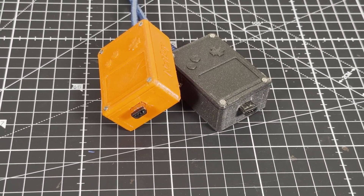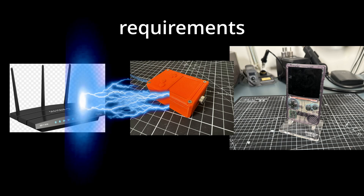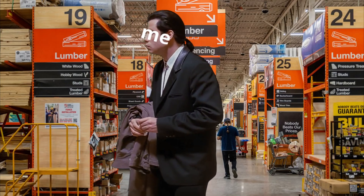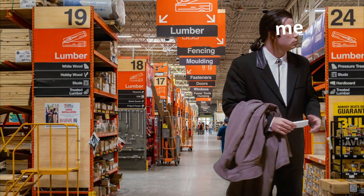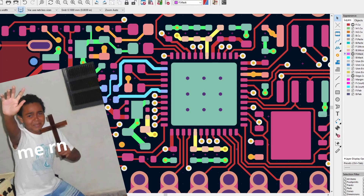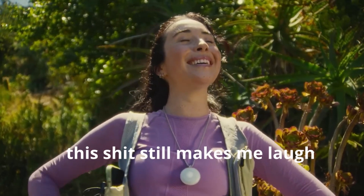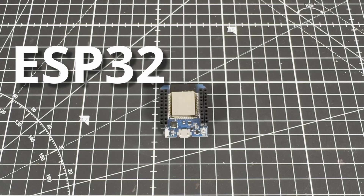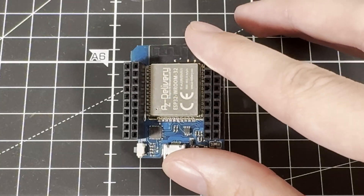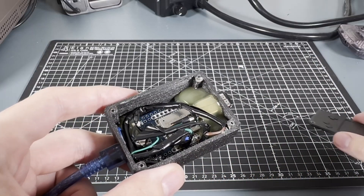We will start by making the actual NetBoy device. The requirements may seem a bit daunting at first glance, as it has to be able to communicate with the Game Boy and handle a Wi-Fi connection at the same time. But where would I even start looking for hardware able to handle such a project? With zero experience in electronics and embedded programming, it's not like I would be able to design my own PCBs. Thankfully, I'm not the only nerd who wants to make useless Wi-Fi enabled devices. So let me introduce you to the ESP32 — this is a bog-standard ESP32 development board you can buy on Amazon for less than 10 bucks, and this little thing will be the brains of our device.